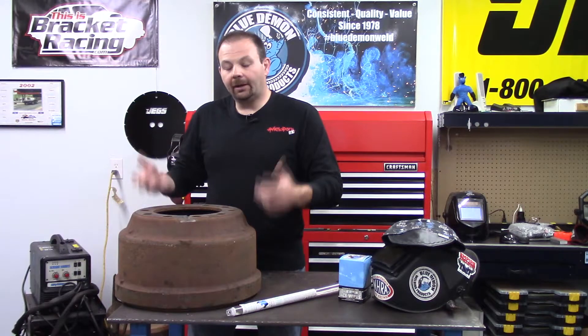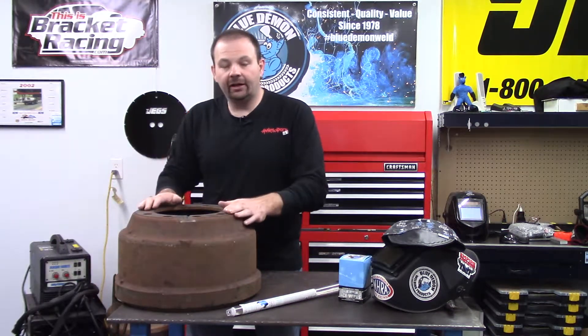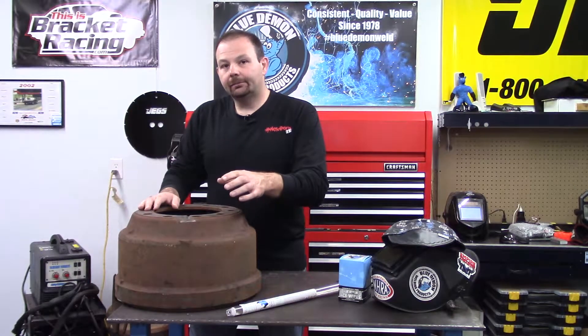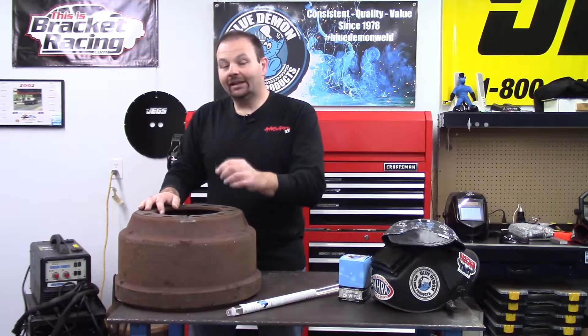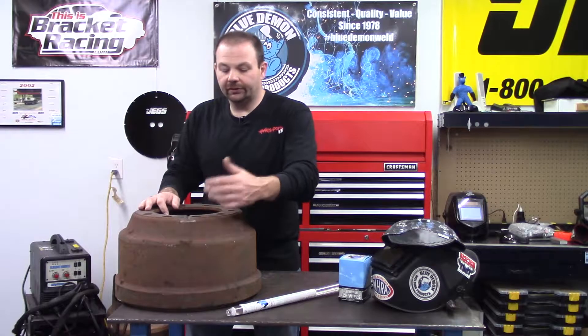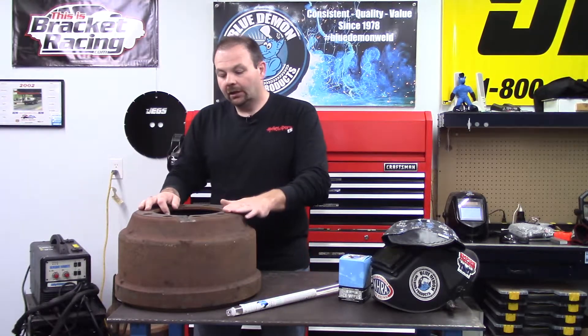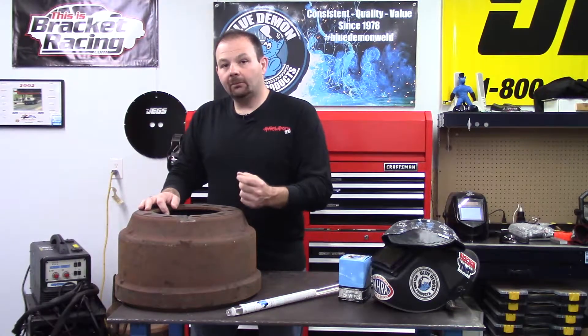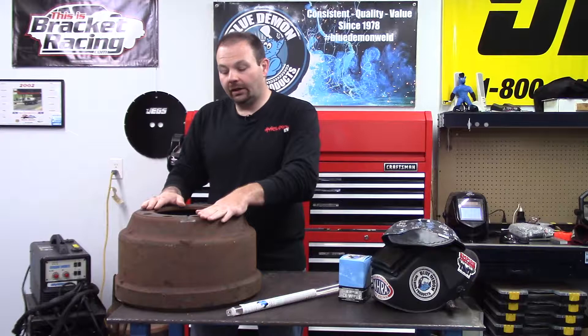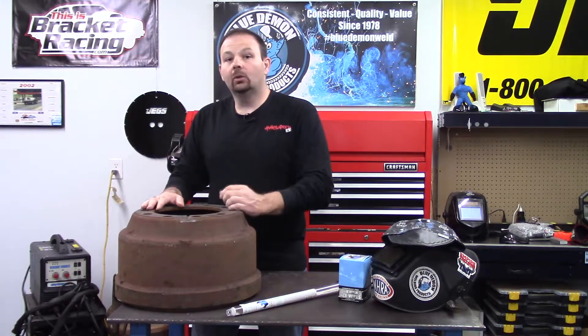In this case, we're going to get this brake drum pretty hot. We're going to bring it up to around 400–450 degrees Fahrenheit, make some beads, and try to keep it around 400 to 500. I'll allow it to cool because it gets a little hotter while you weld. In between my beads, I am going to peen the weld bead lightly to help relieve some stresses, because reducing cracking is the name of the game when you're welding cast iron.